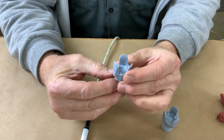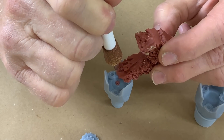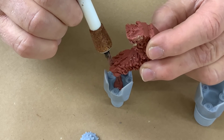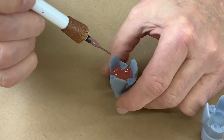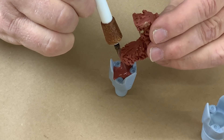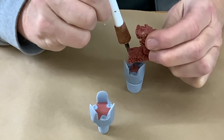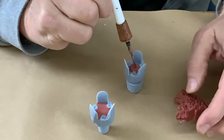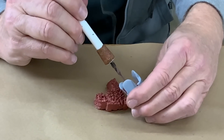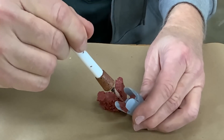These pieces are ready to assemble and fill in and sculpt to their final form. So I'm going to start the process by flowing some wax down in there and filling in the center of this piece. You know how I talk about how you have to design for casting — that really comes from my experience as a toy sculptor and having to design for toys, because I'm not making an accurate model of a wellhead drill. I'm making a toy that looks as much like a wellhead drill as I can get it to look, and yet still fit all of the manufacturing parameters that I've got to hit.